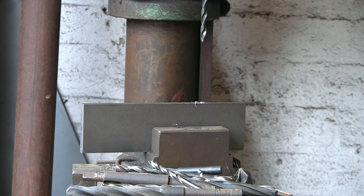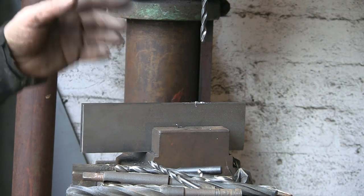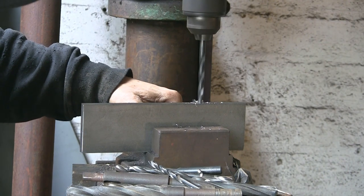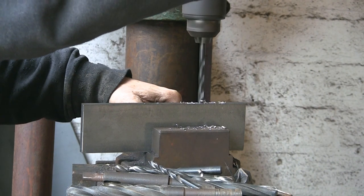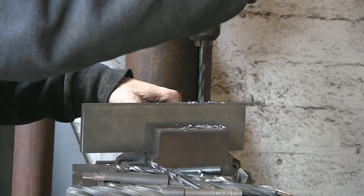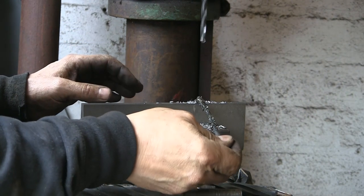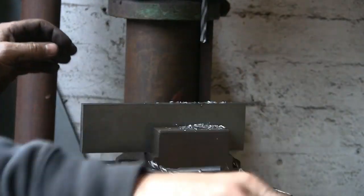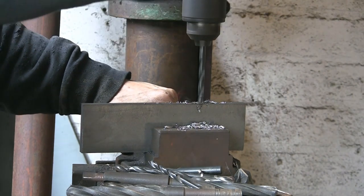What I'm going to do is drill through it width-ways with a 7mm drill. If it was narrow it'd be a piece of cake, but going through this depth the chance of coming out the other side in the middle are very slim. I'm going through at the final size — no pilot — using a fairly new drill. Even though I can sharpen drills pretty well, they're never quite 100% without a machine, and they tend to waver. Going through 60mm of thickness I wanted a drill that will stay fairly central.